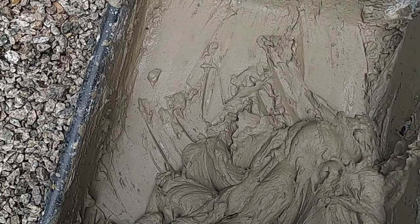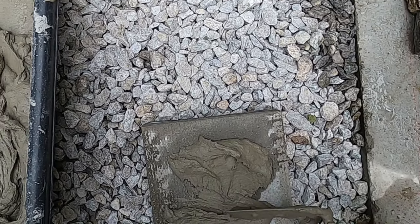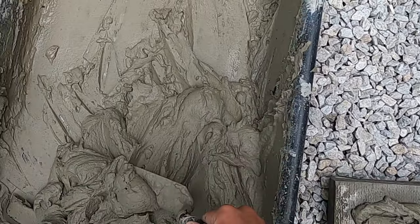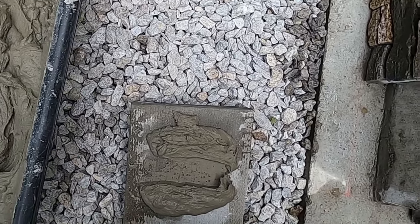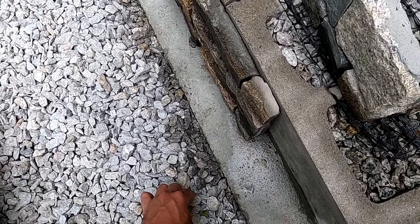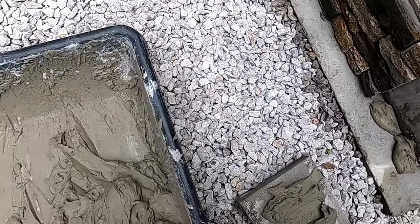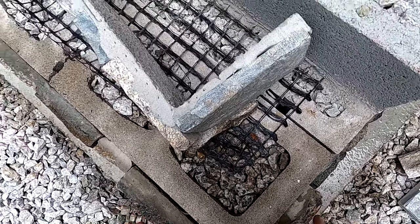With this stuff you really don't need a thick bed of it — that's what it's designed for, is to just put a little bit on there. I like to put rows of the mortar, kind of like tile. Those trowels that make channels with the mortar — you do that, but just in a really big perspective. Do a couple piles like that. Get some on to where it interlocks. With this bottom row we have to lift it up just a little bit, so we're going to want to use a little bit of three-quarter inch stone. Put a couple there to just kind of help support it. Those three-quarter pieces work perfect.